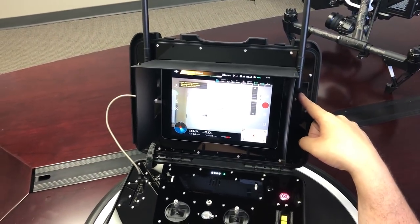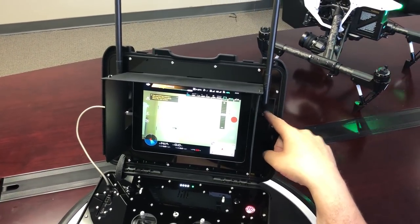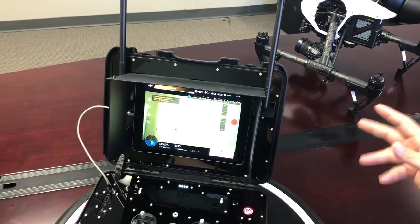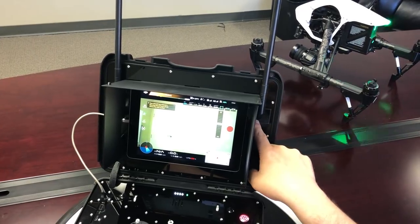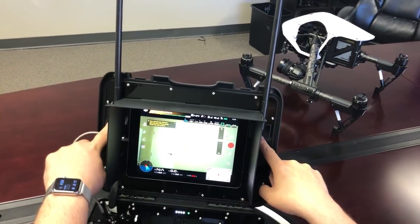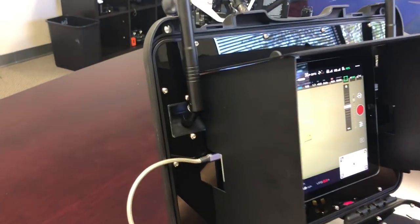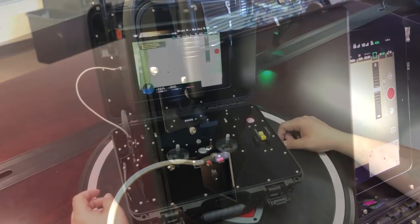We have high-gain Omni-directional antennas on here right now, but you can unscrew these and you'll have access to the RPSMA jacks. You can go out to any external antennas — if you have directional antennas on a tripod, or if you're going out to a car kit, you have access to your amplifiers at those two ports. Just unscrew your whips and run cables to any external antennas you may have, usually directionals or Omnis on a car kit.